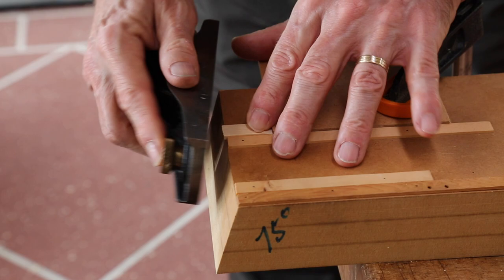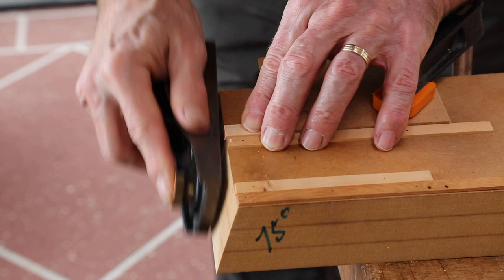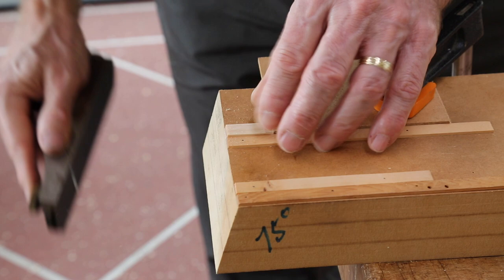Take the six hinge pieces to the 75 degree jig and trim the other end to a length of about 29.7mm. You have some latitude with accuracy on these hinge pieces, and there's not as much need to make too many minor adjustments to the length as there is, say, on the asa-no-ha. So here, a stop block will probably speed up the process slightly.